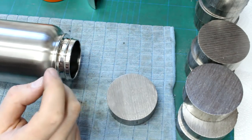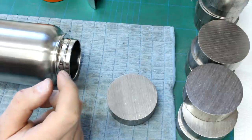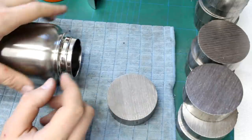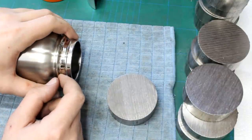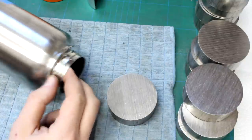I already made one prototype where I tack-welded it — it didn't leak, but the weld was not too nice. It's really thin-walled material. In an ideal case we would laser weld it in a rotary positioner. Let's see how we machine a fairly thin-walled adapter out of this chunk of stainless.